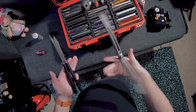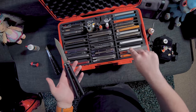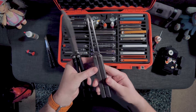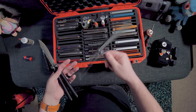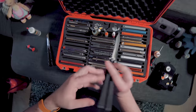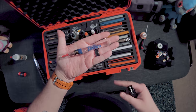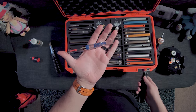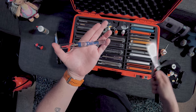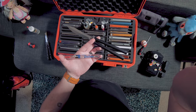I've talked in the past about how you can use dry lubrication on the bearings — you can do that. You can buy what's called graphite powder or graphite lubricant. What graphite powder does is it's a very fine powder made of graphite that you just kind of sprinkle on there and it'll go in — it's a dry lubricant and it will dry out your pivots and lubricate them relatively well. That's a great option. But personally, I actually prefer this thing right here.